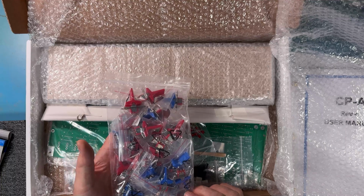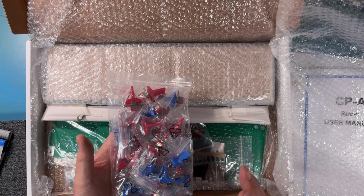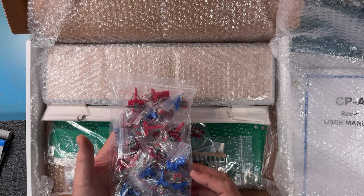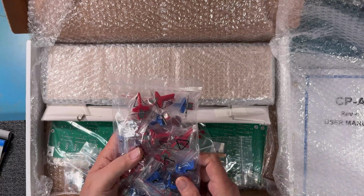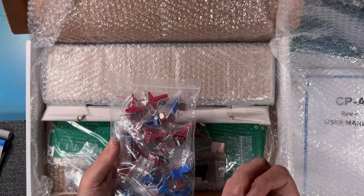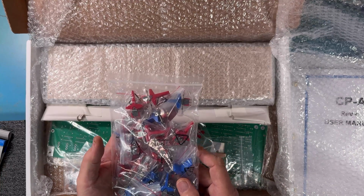The original IMSAI switches had gold or silver contacts, and for low voltage data stuff, you really want gold contacts. The silver are oxidized, whereas you're using the silver with a high voltage like an AC line. The switch will self-clean every time it's actuated. These switches, if you pass high voltage through it, by design, this is intentional, the gold will be evaporated off and the silver will be left behind for the high voltage.